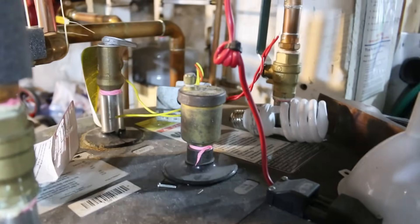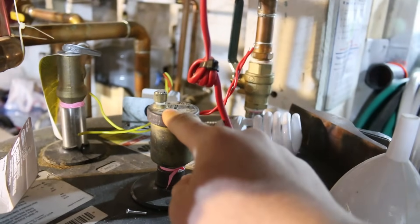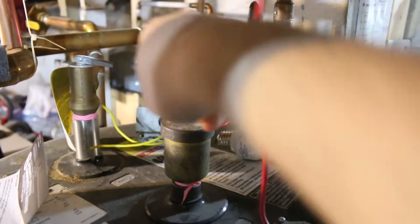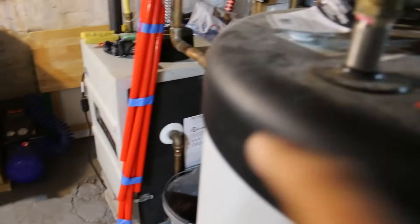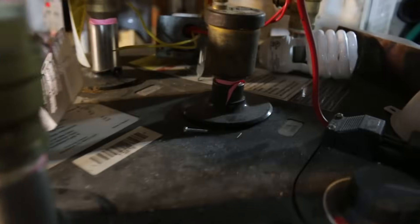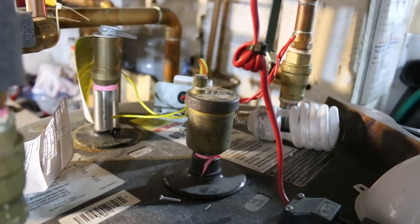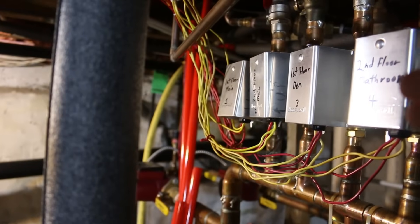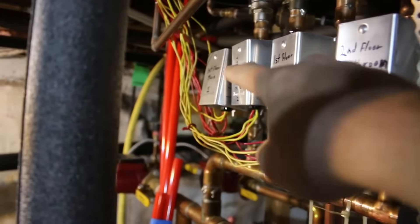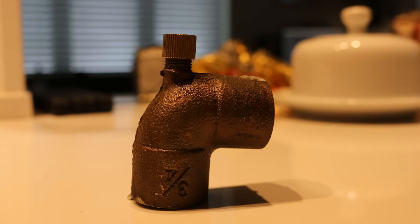So I'm going to cut right to how you bleed your hydronic hot water system. This right here is an automatic bleeder valve. What it does is trap air in the heating loop — the boiler heats up the water, it runs through a coil in my indirect hot water tank, and I'm able to bleed off air trapped in that section of the heating loop. Because this is a two-tier system with two loops — one for the indirect tank and one for the heating system with all the zone valves — you need to bleed the air out of the heating loop.